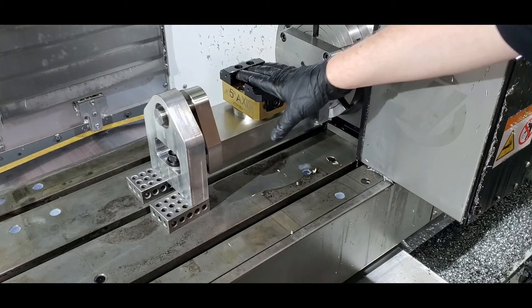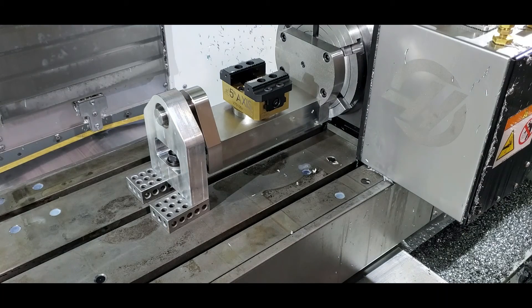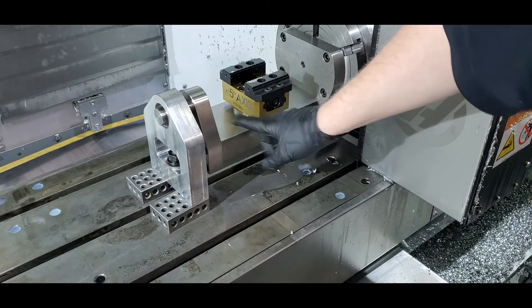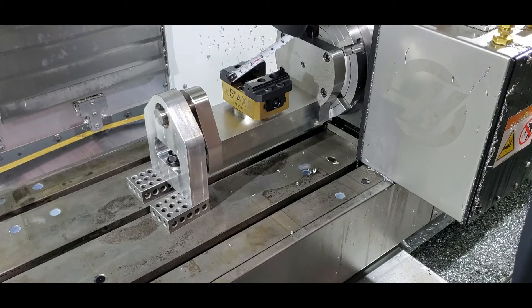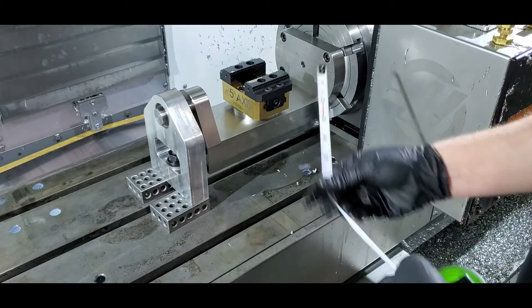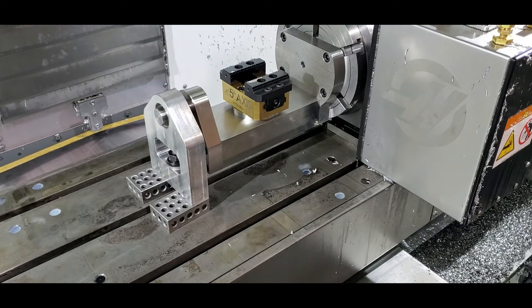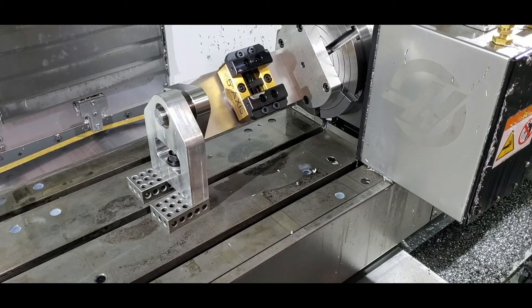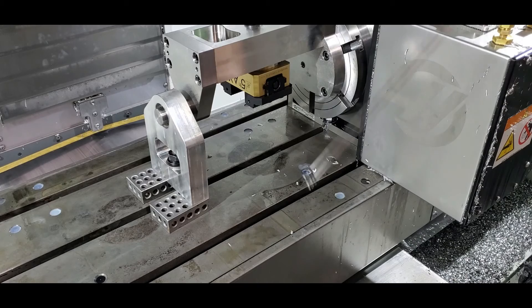It's now rotated — it's not 5th axis, but it'll knock out most everything I want to do with it. I'll probably be using 90 degrees most of the time, but there are those 15-degree increments just in case. For specs: I believe it's a 3-inch jaw, with 4 inches here and about 8.5 inches there. When rotated, we can definitely get a bigger piece in there, and that 8 inches on center will not hit the bottom. Looking good so far.